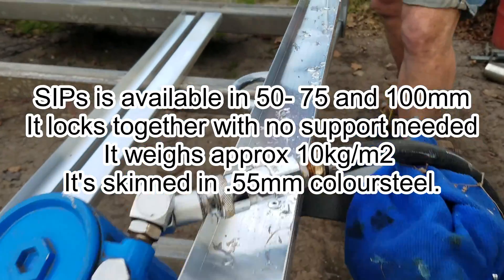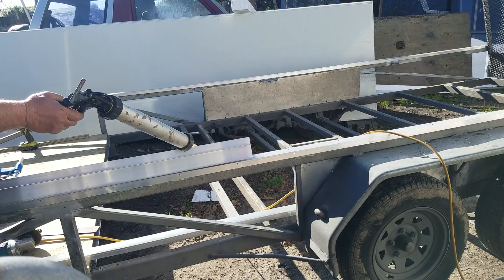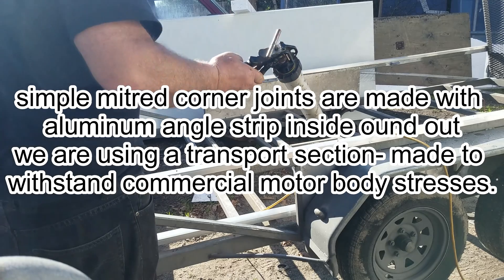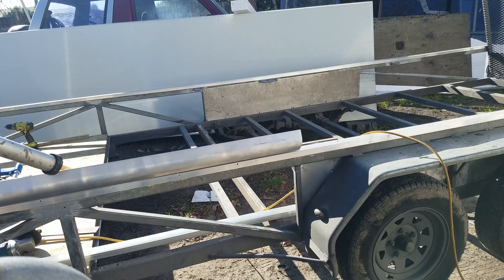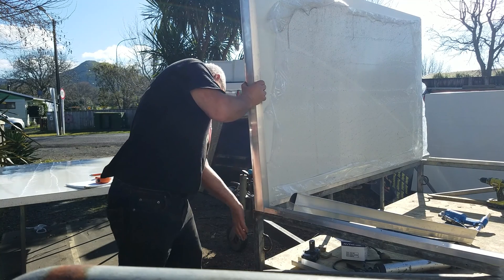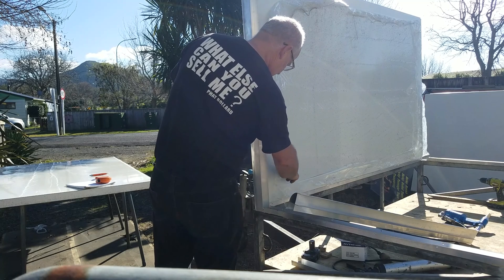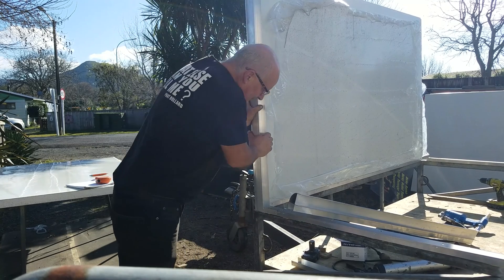This is the bottom track for the panelling that we're going to be using to finish the top half of the job. That's held down with a special adhesive and hundreds of rivets. The corner sections are next - we start from one corner and then work away. I'm putting in a corner post onto the front panel. Every join gets glued and riveted, and the rivets are put in at about 200mm spacings - that's about 8 inches. You'll see that I've removed the plastic protective covering off the panel from the edges so the glue can get a good grip. Everything just gets tapped into place, then we move over with the first of the side panels, which simply locate into the same corner moulding. Another one of these goes on the other side.